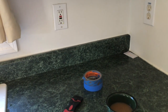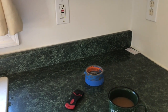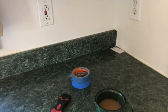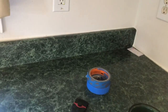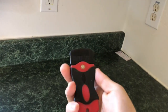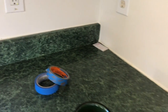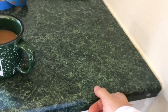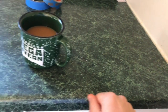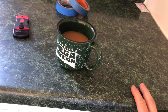So today's prep work, which from my understanding is probably one of the most important things. So today, scrape off some caulk, get it taped up, and then use some acetone, which actually was a tip someone gave me, that if you don't clean off this shiny surface, the paint will actually peel off very soon.